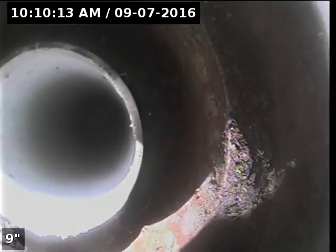We're going to go ahead and head downstream. We have the riser and we're heading downstream. As soon as we get down the riser, it now looks like four-inch PVC. We hit a little bit of a 45-degree bend. No standing water at all in the line, which is good. No roots. Then we hit a vertical bend going down, dropping in, and we hit another bend going to the left.